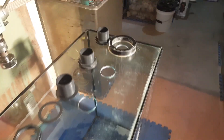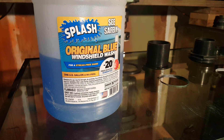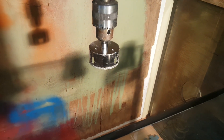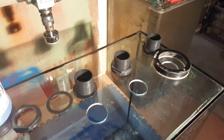One little trick I want to point out — you'll probably see 200 videos on YouTube about guys putting water on the hole saw. You can also put on windshield wiper fluid. It's quite pungent — it stings the nostrils in a good way. There's something about the fluid mixed with the water; it doesn't create bubbles like soap, but it acts as a cooling agent and it helps for the diamond hole saw. Maybe like a 50-50 mix — put those two together and that saw will just walk right through.